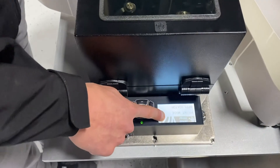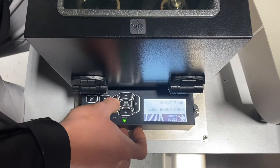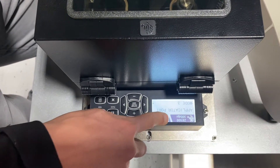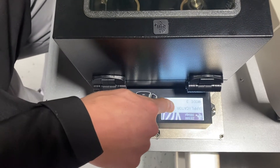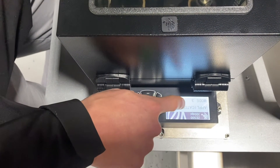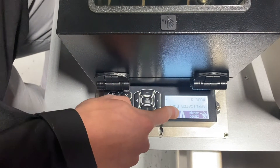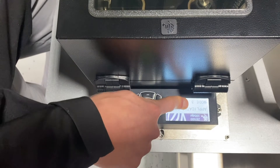Print mode. Because we're in an applicator, we should always be running in applicator mode. The next setting is going to be applicator port. Depending on what type of machine you're interacting with, this is super important — this is the language that the printer speaks to the applicator. If you don't have this right, we're not going to be able to send the printer a signal to tell it to print and when to stop printing. So you've got to make sure that this is accurate, otherwise the operation is not going to work.